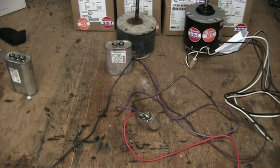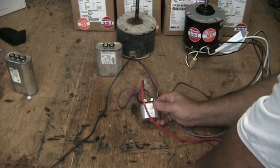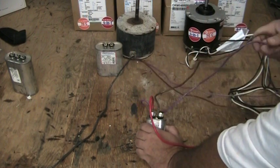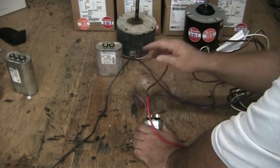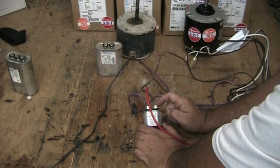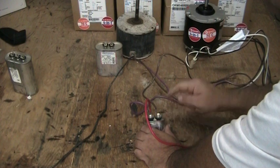There's one other possibility. You might have in your unit a capacitor for your compressor and a little separate capacitor that goes to your outdoor fan motor or condenser motor. To determine which capacitor goes to your outdoor fan motor, just trace the wires from the outdoor fan motor back to the control box, wiggling them back and forth to find where each wire goes. The wires from your old outdoor fan motor will plug into that motor run capacitor.